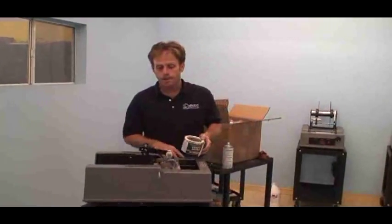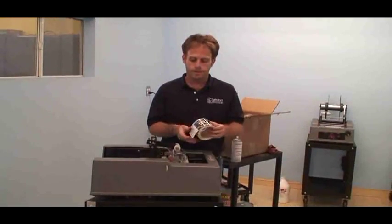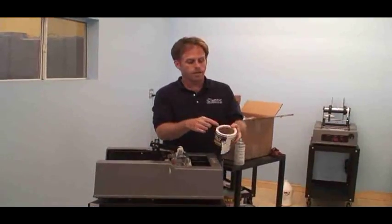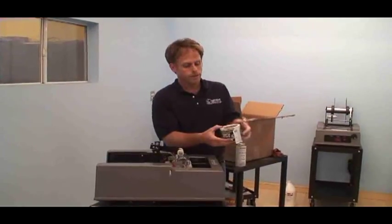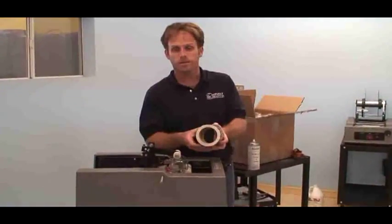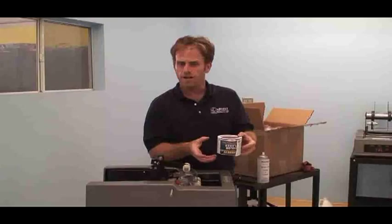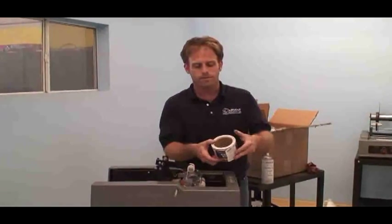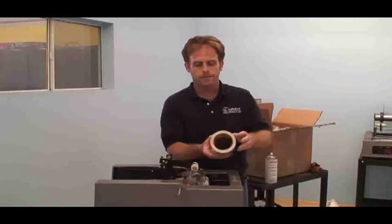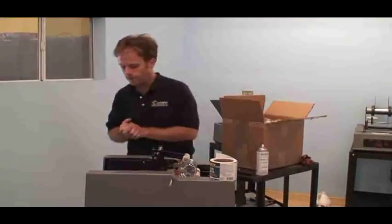We're going to demonstrate an Advent 310 for ASCO. We received your labels in containers. Your labels were not on a 3-inch core, so we had to wind them onto a 3-inch core. Obviously, that's very important to use any type of labeling machinery. Some of the labels bubbled off the liner. I tried to reattach them, but it should work fine. You've got to make sure they're nice and tight, and they should be if you took them off a roll of labels.